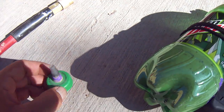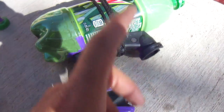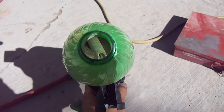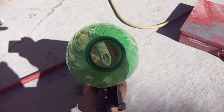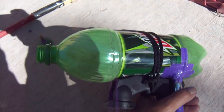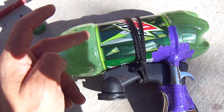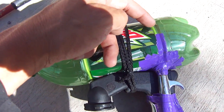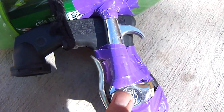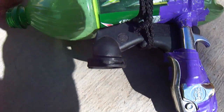Real quick one — right here, a Mountain Dew bottle. It's just a handle from a spray can. You can see in there that tube — the wire in it — it should be directly across from this exit hole right here. The tube goes up, curves — I put that wire in it to manipulate it the way I wanted, so it goes up like that and comes straight. It's sealed very tight. It connects to my air supply — that's it. Hook up the hose to it, fill it with sand.